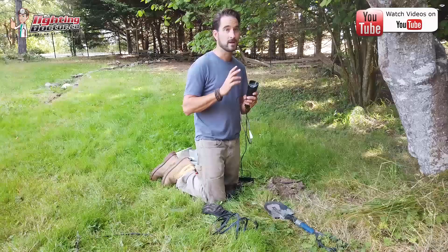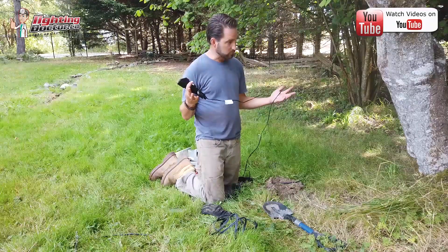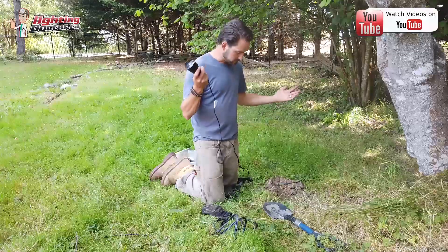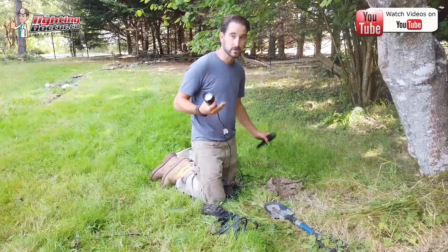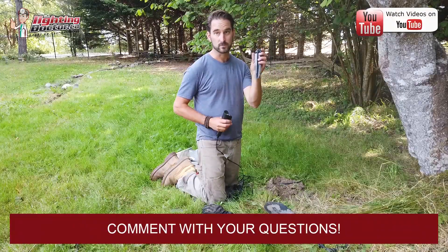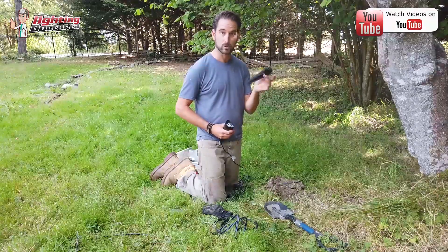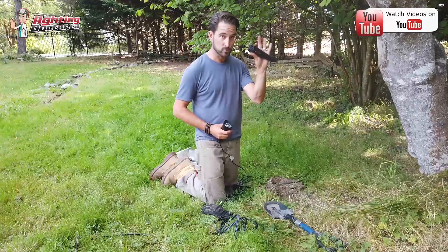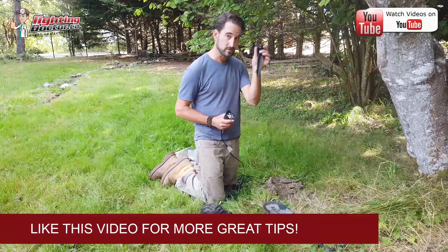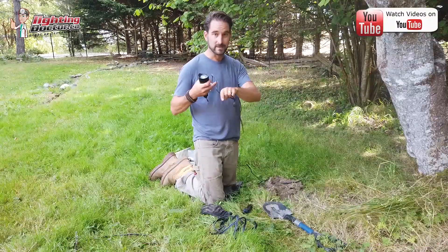We're doing a lot of up lighting and down lighting on this project, and this is kind of our staple fixture — the RS up light. I like it for so many reasons, but one is it comes with a really durable ground stake, which you don't always find with lights from Amazon or Home Depot. Those cheaper stakes break really easily. These stakes won't break — the light might get hit by a tractor and get knocked out of the threads, but the stake itself will not break, and you can usually just screw it back in.